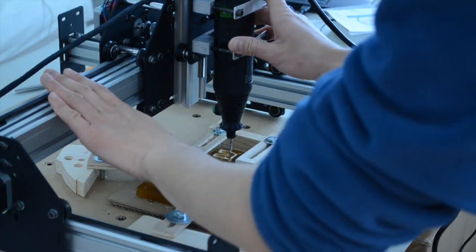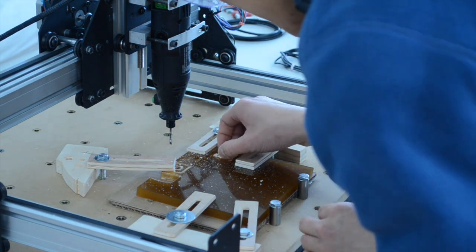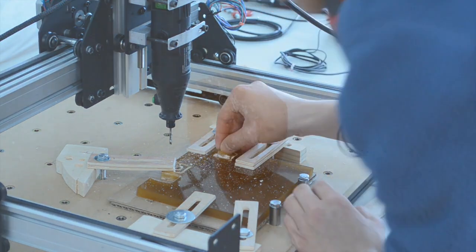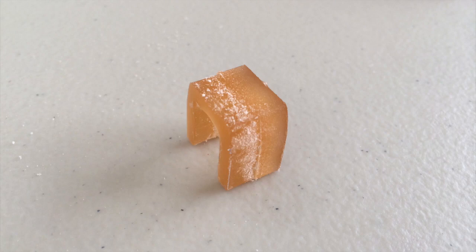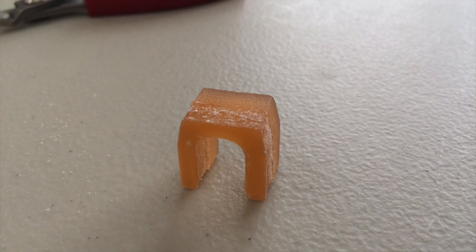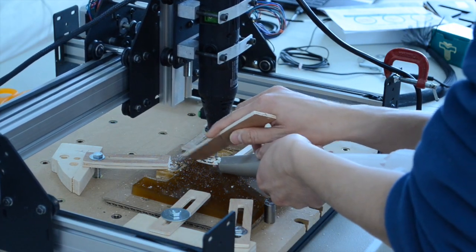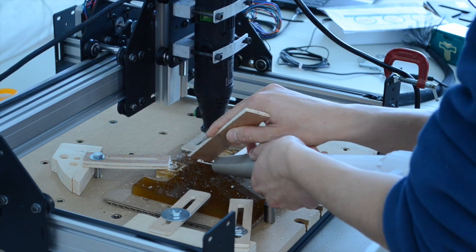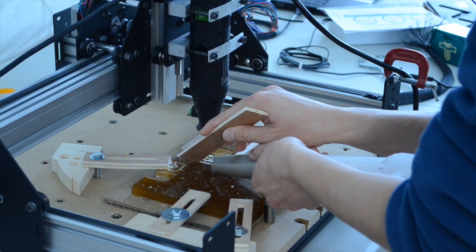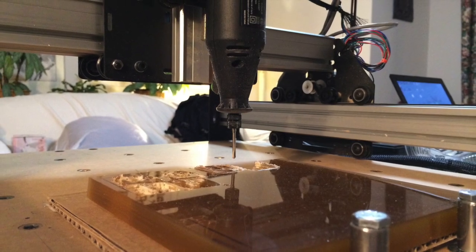By varying the pre-programmed end mill's size, I could also add or remove more material from the spacer to compensate for the rebound of the polyurethane after cutting. In terms of finish, these spacers are definitely not too pretty to look at — I'm going to have to look at using an abrasive to smooth out the edges. In hindsight, I should have just started out at a 90A durometer. Even if I'd overshot the appropriate hardness of the original pieces, it still would have had enough give to safely support a glass tabletop. Lesson learned: if experienced machinists say it can't be done, don't do it.